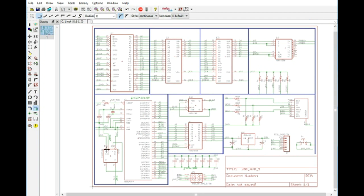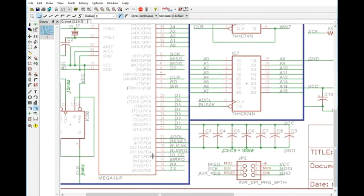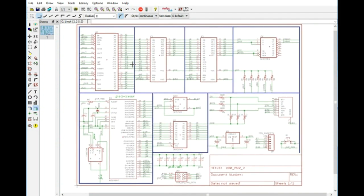And that one can be described as being this one here, because we are using this particular chip here in order to generate both the clock and the interrupt for the AVR, versus the other computers out there that simply just, you know, pin to pin. And I think the MBC, it actually uses one of the oscillator pins here. I think it's OC1A as the clock oscillator at 4 megahertz for the Z80. We're not so worried about that because, you know, this is a little bit cleaner way of doing it, and it doesn't have any software that it has to worry about there.